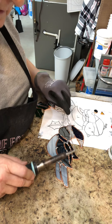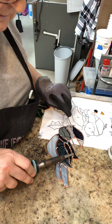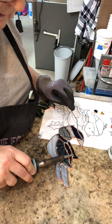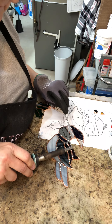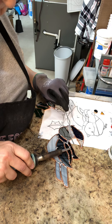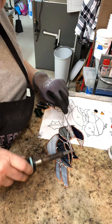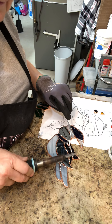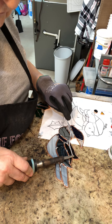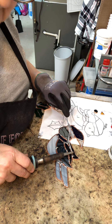Another method is to take a bit of solder, drop it onto your line of copper, and then continue doing that, like so. Some people have that preference. My preference is to lay my solder down with my iron at a 45-degree angle and continue across.